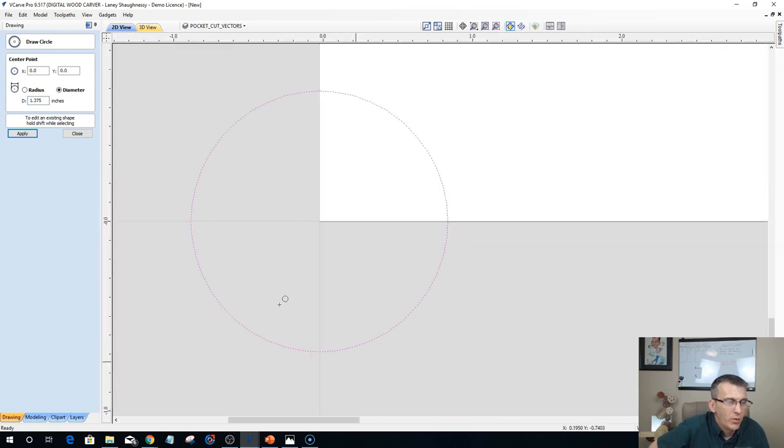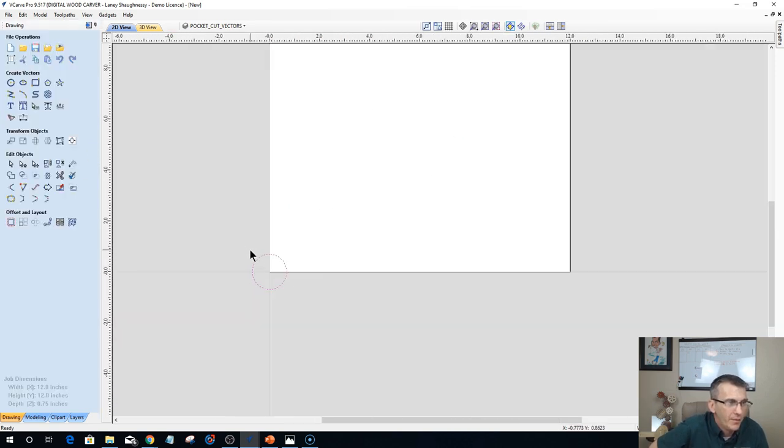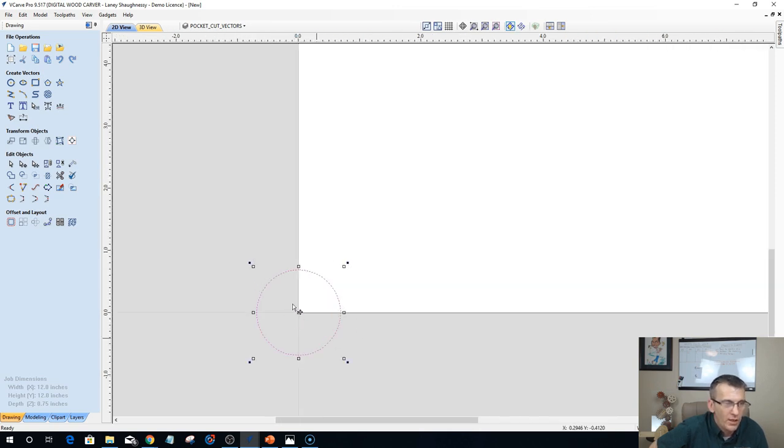Zero out that bit on your XY zero, and that bit will run the toolpath lines. You'll create your toolpath, and it'll raise up, turn on, run that first one, raise up, come back to the beginning, run the second one, raise up, come back to the beginning, run the third one. You only zero out your X and Y one time, and touch off your Z on the top of your board, and you run it one time. You do not reset. I don't think there's any job in its entirety that you would ever reset your start point every line.